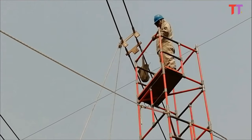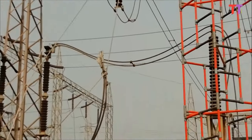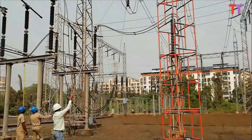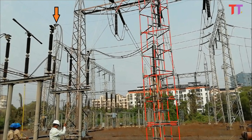We could clearly see a spark between the conductor and the pulley. This spark occurs at the moment when the conductor goes beyond the induction zone of the power line. Also, please note that the other end of the conductor must not be loaded and must be isolated — meaning there should not be any load current flowing through the conductor which is to be removed from the main power line.